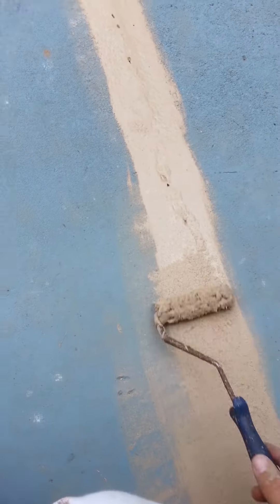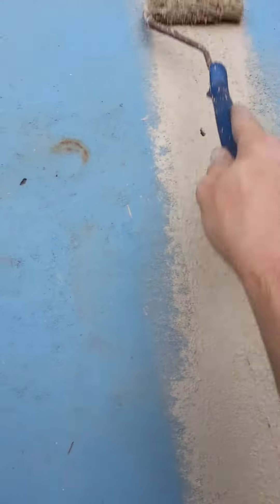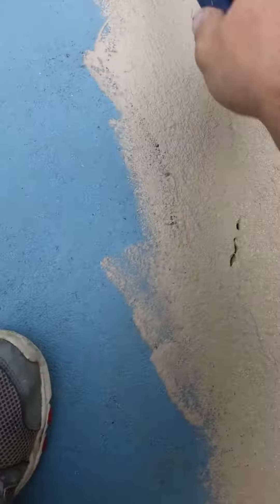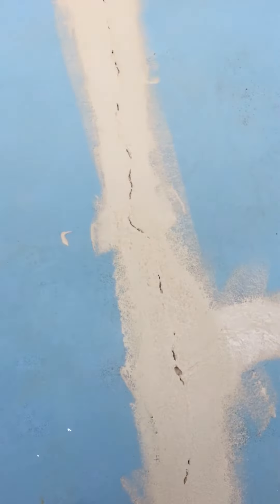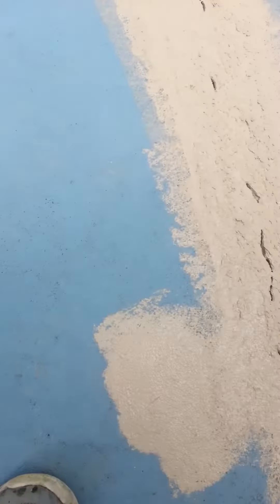Over here there's a stress fracture in the actual concrete. It's already been filled, but you can see there are some holes that will need to be filled later. What I would probably do, after this texture coating sets up, is put some kind of primer that bonds to this stuff really well, so when it goes down into the holes it grips to the hole itself and gives the next coat the ability to backfill.